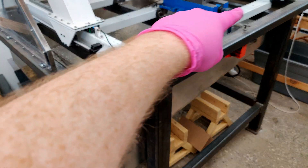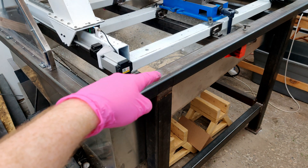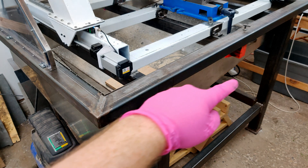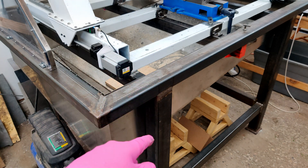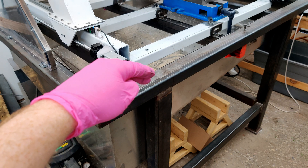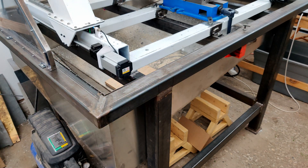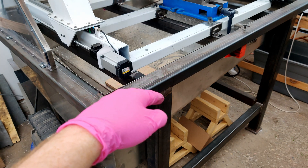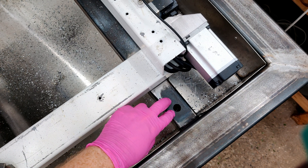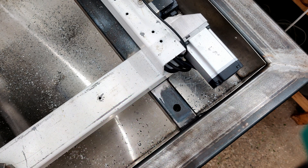For the big rectangle here, I was thinking of putting holes in the corners, but instead I might cut a big square out to get access for drilling into the columns. Otherwise it's not really easy to fill them up. I could pour grout into each column up to the tube and then use those same holes to fill the rest of the tube. Afterwards I'd close that hole by welding a piece of plate on there, or make little steel circles and cap them off so coolant can't get into the tubes.